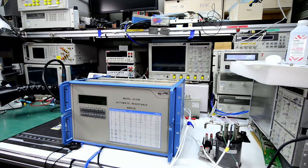All right, so what happened is I was running some resistor transfers with 1 ohm to 0.1 ohm, and then was switching to 0.1 ohm so I could do some testing for resistors' temperature coefficient, stuff like that. Usually I set up the experiment to run from a Raspberry Pi Python script, so it would talk to the bridge, talk to my environment sensors and control air bath chambers. So I could change the temperature of the resistors and see how they behave at different temperatures and do all the different measurements and experiments.